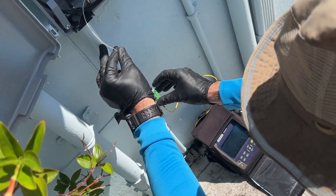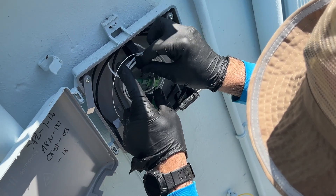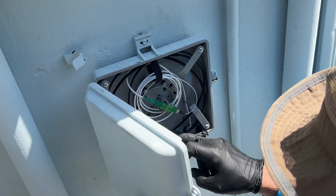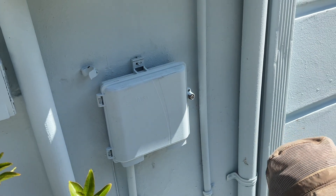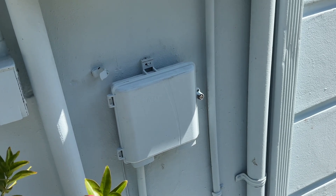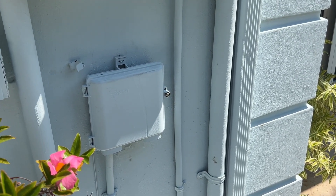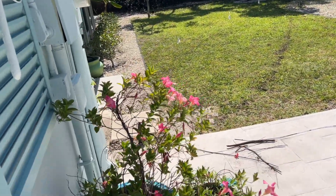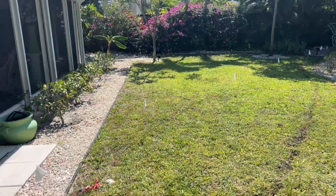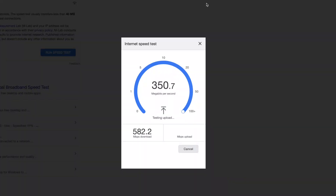There's a little ding. That's in now. Does it have to go in a certain way? Yeah, there's a raised edge on the top that goes into that slot. This tells me my dB loss. What's dB loss? It's basically the amount of light loss — like stops. There are six stops, six junctions. So you've got fiber optic splicing on it. There are stopping points like splices, connectors, and the main box. Everything's passing. That's what we need — passing marks. Now we just plug it in and reset the modem. The modem will come up on its own. You didn't factory reset the modem did you? No. Good, because the last guy did that — he had some static IP and was there for an hour just trying to stream. I knew what happened. These chuckleheads will say 'oh hold the red button' — they cut it outside. So we put up flags so nobody runs over it and cuts it again. They've got to come out and rebury everything, but pretty much we're done.